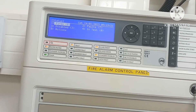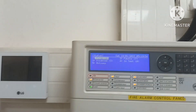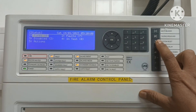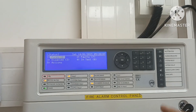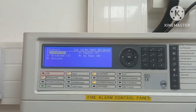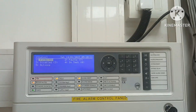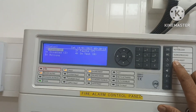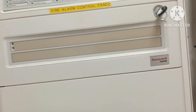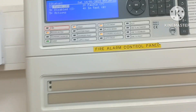If you check the alarm and it is a false alarm, you can reset it. If there is a real fire in the building, the alarm will come again because the smoke still exists there, so you cannot reset. If someone pulled the MCP and you will not go there, you will only reset the panel — the alarm will come back again.